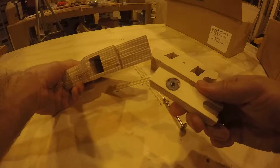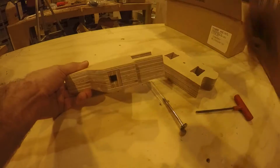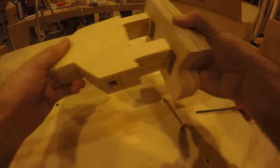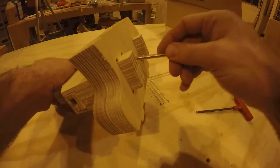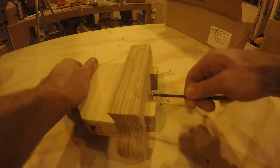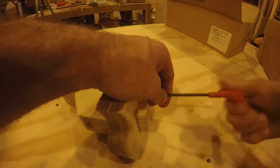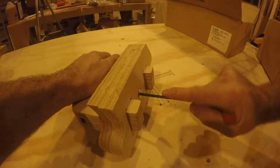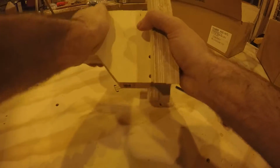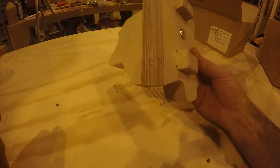But simply, this is just a T-nut on this little piece of wood. You put it up in the hole like that, and you take this, stick it together, put our bolt in like that, it engages in the threads, and you just go ahead and tighten this right up. Give it a few turns here. It bottoms out, crank it down nice and tight, and you get a perfectly tight joint that isn't going to move anywhere and is super easy to assemble and incredibly strong.